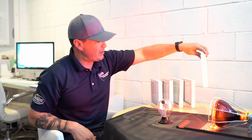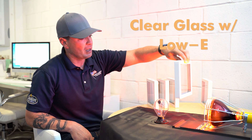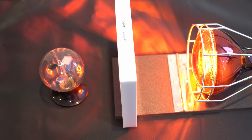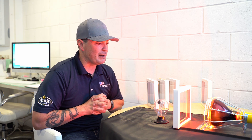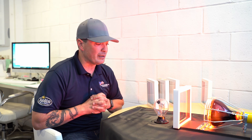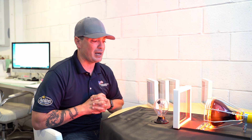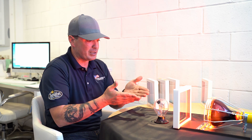There's going to be no rest for this little bulb. If we get rid of this and go with the 270, or double layers of low-E, we can put this here in its place. I can already feel that it got cooler, and if we stay put for a second we'll start to see this slow down — and it's already starting to slow down. Now, it's not going to stop because this grade of low-E is still going to let in about 35% of the heat gain throughout the day. It's better than clear, but it's not going to be your highest performance low-E. If you live in the desert or areas with very strong sun, you'd want a higher grade than this, but as you can see it's starting to slow down.